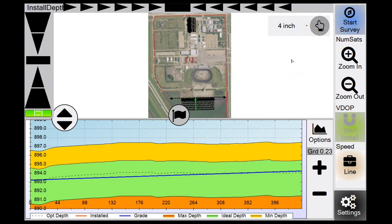For guys just starting out: get to your high point on your ditch, open a project, hit Start Survey in the top right corner, drive down to your outlet, hit Stop Survey, turn around, drop the plow into the ground, and hit Start Install. That's the basic function of tile.